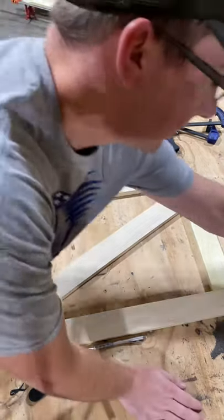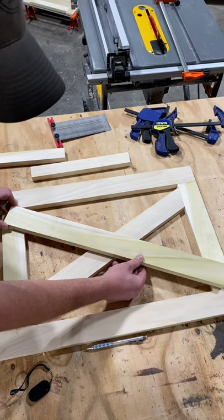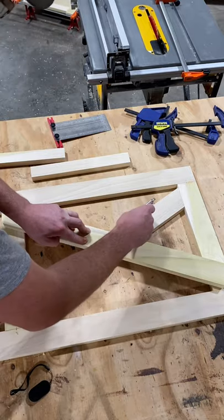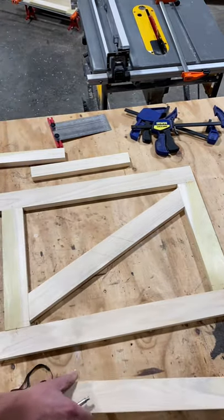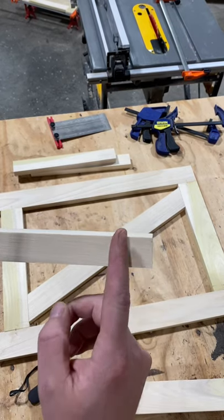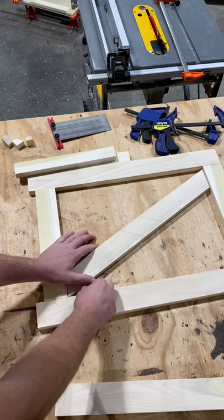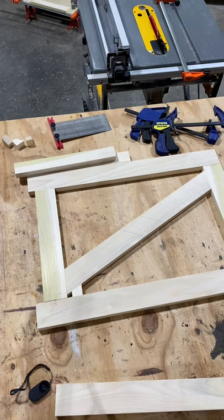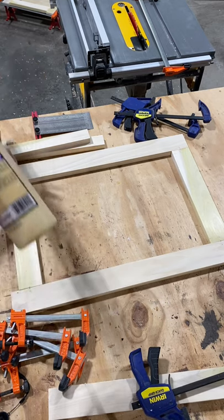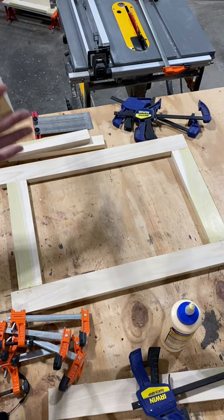Head over to your saw and cut that angle — you almost have a perfect fit. Take another one, line it up on the line going crossways, and draw lines right across the middle of the other X to help align the smaller pieces. You could do a half lap here but this is decorative and will be more than sturdy enough. This angle was 26 degrees for me — cut eight little blocks at 26 degrees. These little stops fit in the corners when you go to clamp, so you can get a good glue clamp. Really gob on that glue, don't be afraid of it — it'll help seal that butt joint.